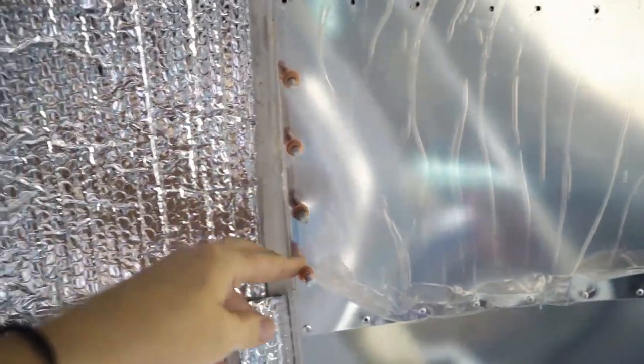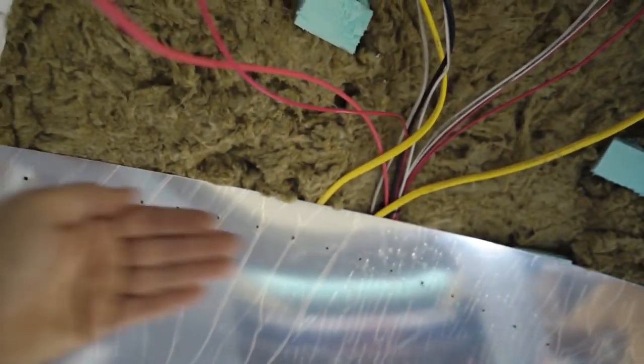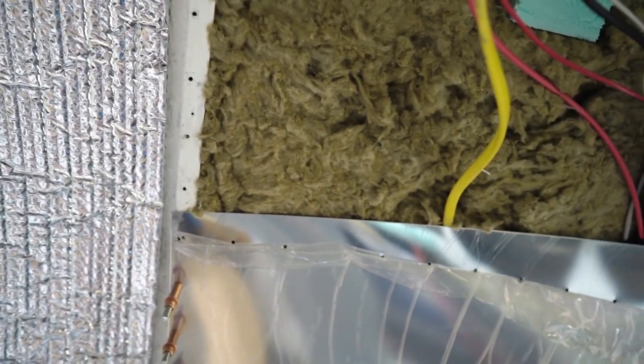with the least amount of movement as possible. And then we'll start to pop rivet this piece in, now that I know I don't have to move it back and forth or here or there to get the angle or the radius that I want. So plastic is pulled back like so. Now I'm gonna go ahead and put the piece that I just removed back up, put all the clecos back in, and start working the metal and pop riveting it in.